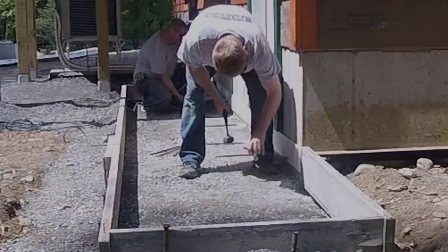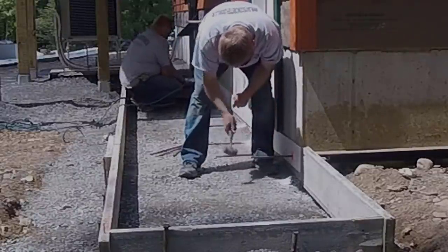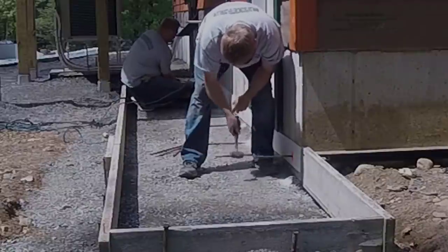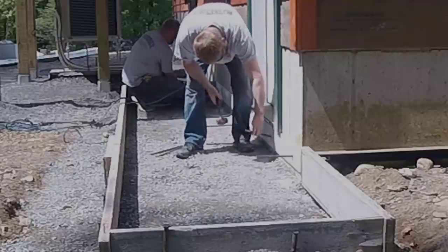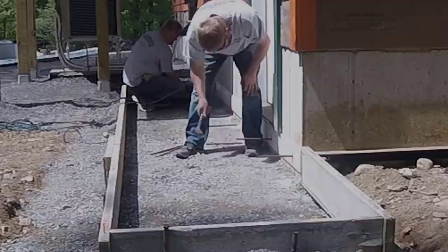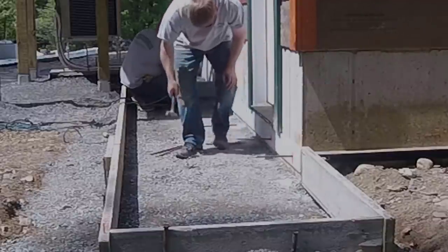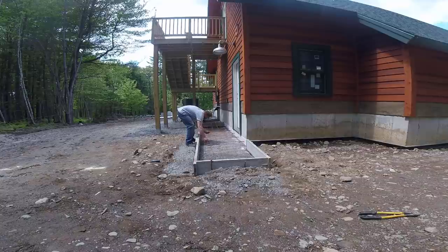It's probably not going to move because of the gravel he's got under this and the drainage, but we just want to ensure that this sidewalk doesn't lift at all and damage that door — we're right up under the door. So we drill and pin with a half-inch masonry bit and then we pound in some number four half-inch rebar, leaving it sticking out about a foot. That'll keep the slab from ever lifting.